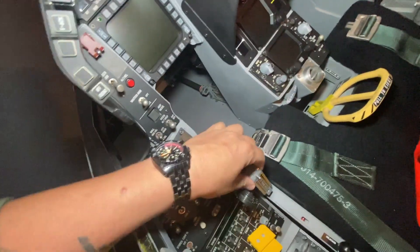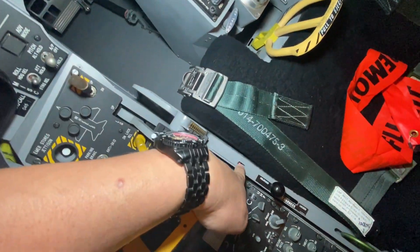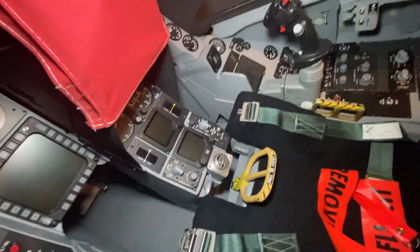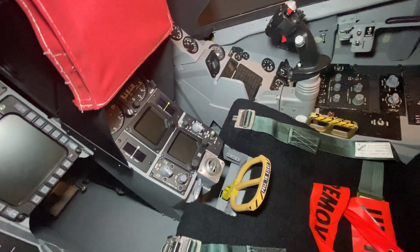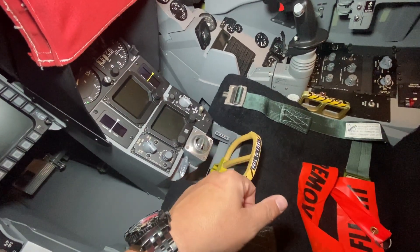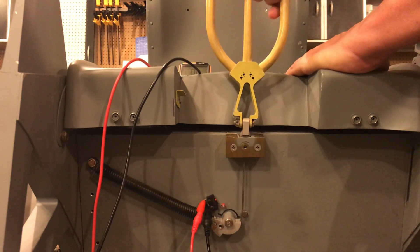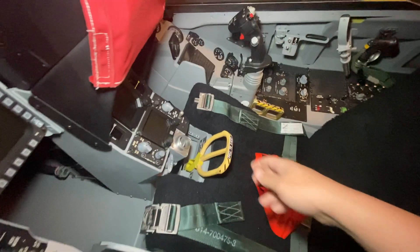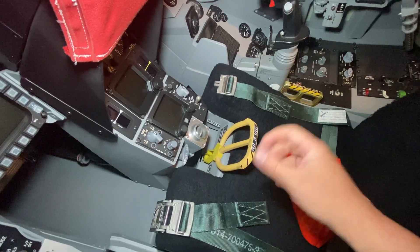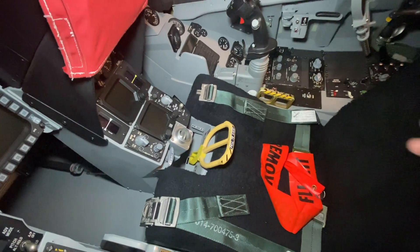The arming lever, as I said, was functional. I just put a little tiny micro switch inside — that's the little red tab you see there — and that makes the switch pretty much functional. The ejection seat handle I changed out. I 3D printed a little round turning device that I got from another cockpit builder, and that made it functional. It's got a five-pound spring in there that allows the handle to travel about three inches, then inside it triggers off another micro switch. You just pull it up and it goes right back inside.